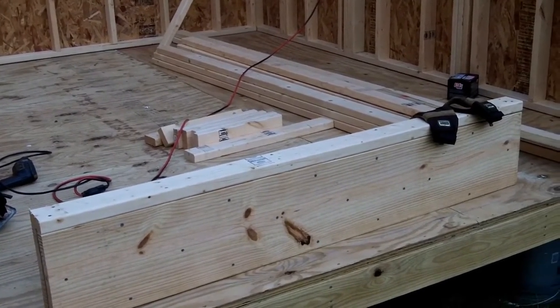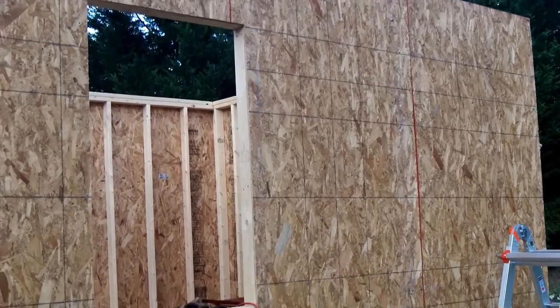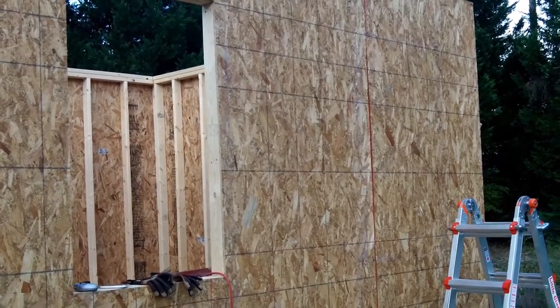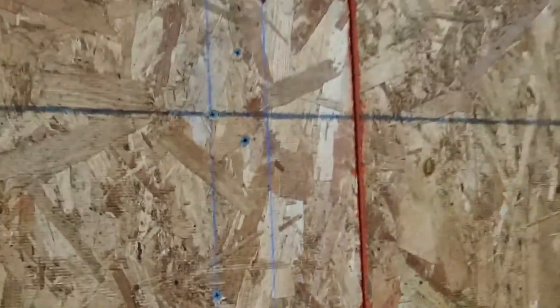I'm going to call it a night and tomorrow I'll try to put that wall together. One thing I wanted to mention about the windows — I put plywood over those. I saw online an easy way to do this: get a screw in each of the four inside corners of the window and leave just enough for me to run a chalk line to all four corners. You get the chalk line going up, over, down, and back, then take your circular saw and just cut it out.